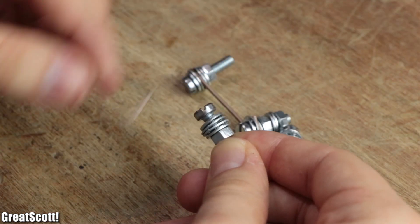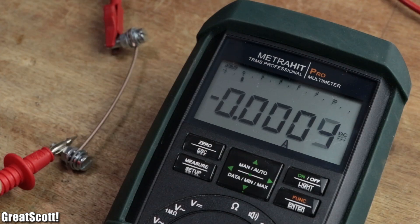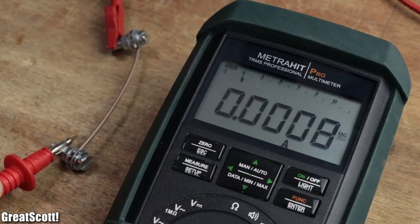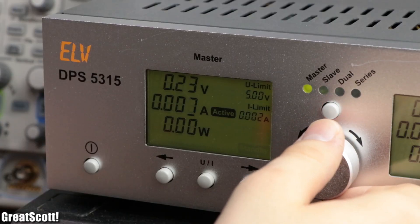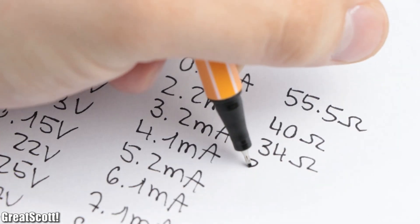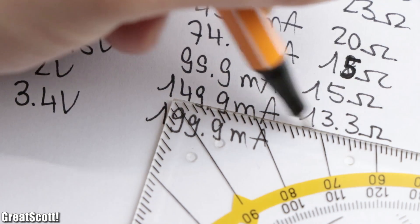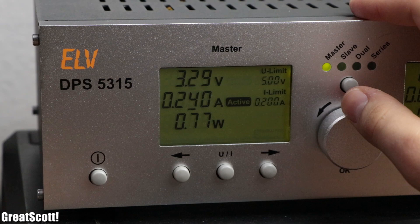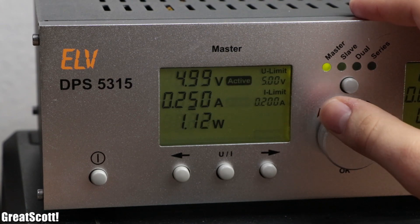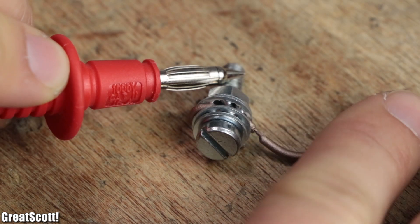To get more accurate results, I placed a single 10 centimeter piece between two bolts and directly connected it to my lab bench power supply in order to let different constant currents flow through the filament. After recording dozens of values and calculating the resistance, it reached a minimum of 13 ohms at 150 milliamps, right before it increased again. After this point, while continuously increasing the current, the filament slowly heated up and broke through its hotspot at around 1 Watt of wasted power.